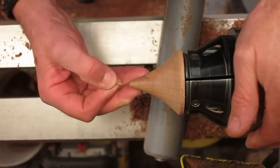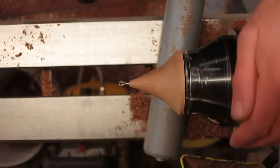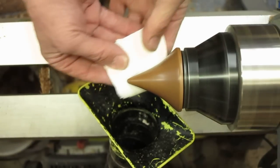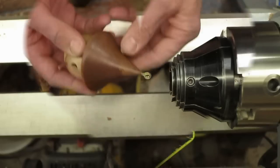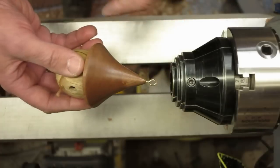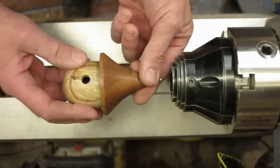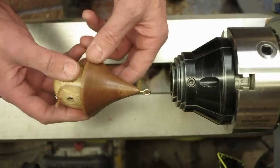I've just checked that it all goes together okay — yeah, that's fine. I'll sand this off now and come back when applying the final coats of Hampshire Sheen. That's the lid and the body done. Here's the finished birdhouse with the roof CA'd to the body and a little brass eyelet in the top to hang it from a ribbon. They're great fun to make, especially at Christmas time — you can use plainer woods and paint them to make them very festive. They're great fun and quite easy to turn. I hope you enjoyed the video and thanks very much indeed for watching. Don't forget to subscribe and I'll see you soon. Cheers!